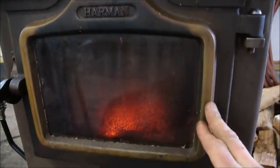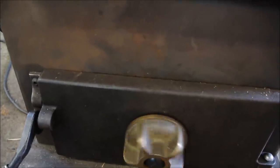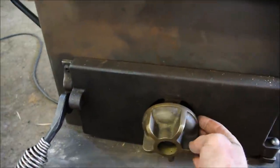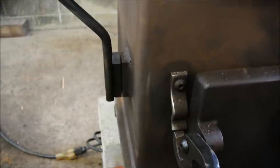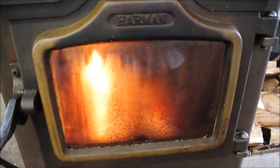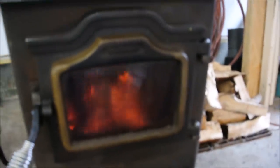This is all brass on the front, which is, needless to say, beautiful. And this is what you can use to dial in your burn perfectly — this allows more air in. Since I'm using wood and not coal, I believe I need to give it more air. I've been running it with just a crack open, and it seems to burn really nicely. If I'm in here I leave it open and it radiates more heat; if I go in the house, for safety, I leave it shut.